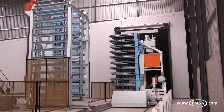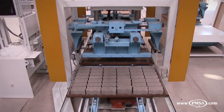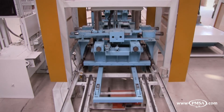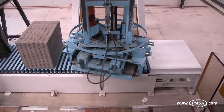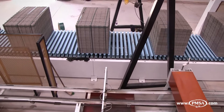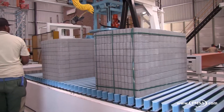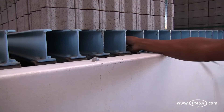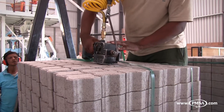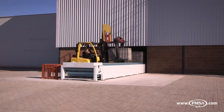After the initial curing in the curing chamber is complete, the product is removed from the racking system and taken to the destacker. Here, a block pusher is used to push the product together and center it accurately onto the board, ready for the pack head. Bricks or pavers are then packed and stacked using the pack head, which automatically stacks dry wall products from the pallet into the correct pack size onto the slat conveyor, ready for strapping. Strapping can be manual or fully automated depending on the client's requirements. Manual strapping is facilitated by a slat conveyor with open slats, allowing easy feeding of strapping material underneath the product packs. The slat conveyor moves the finished packs into the outside area, where a forklift fitted with a grab can easily lift them.